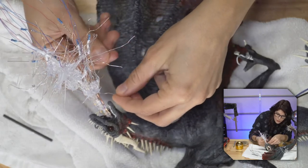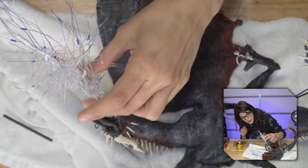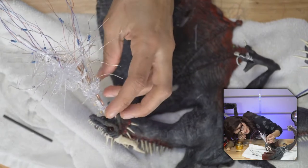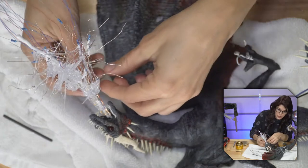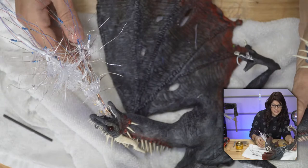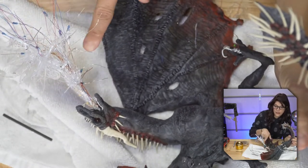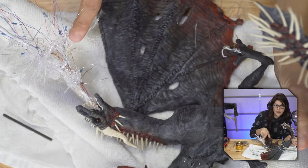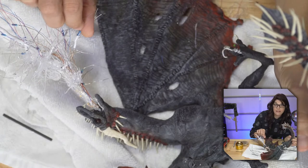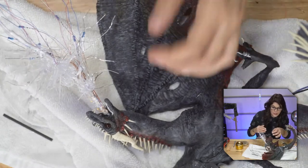Okay, so that's the negative of this bulb right here. I'm going to go look on this side, and that's the negative of this bulb. All right, making sure we're doing negative with negative. If you look very closely, let me see if I can lean this guy a tiny bit. You'll notice, maybe right here, that I was able to put tiny, tiny heat shrinks and I painted them white, just to avoid any type of shorts that we may encounter.